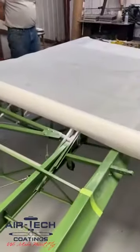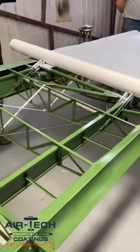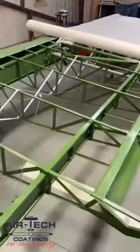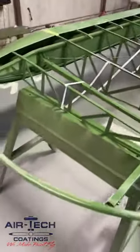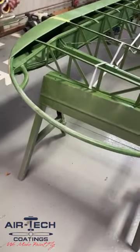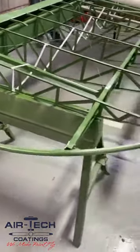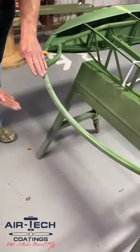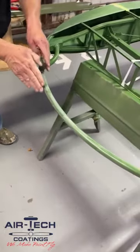All right, so we're going to roll the fabric out on the wing. I've left a couple of 3 inches overhang on the other. We'll roll it out. On the tip end of it, on a J3 wing, fabric is one of the most inexpensive parts of the covering process. So I like to leave 6 inches or so, so you've got something to hold on to when you're going to iron that around that.